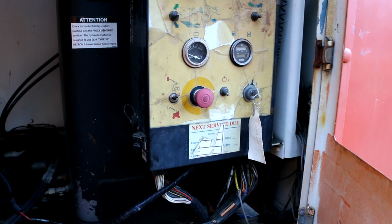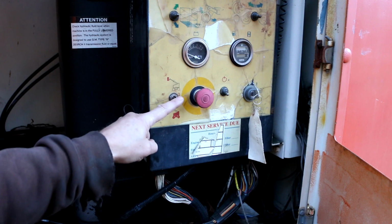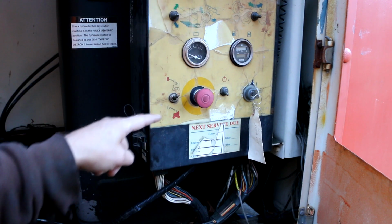They appear to be sending their appropriate signals down here to this controller. And not only that, but the controller appears to be sending outputs. So I've got a problem where, for some reason, the outputs aren't actuating the solenoids, the hydraulic solenoids. So very interesting.